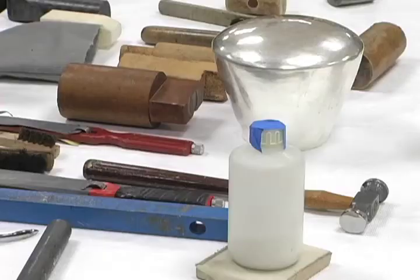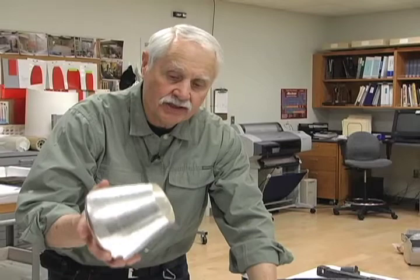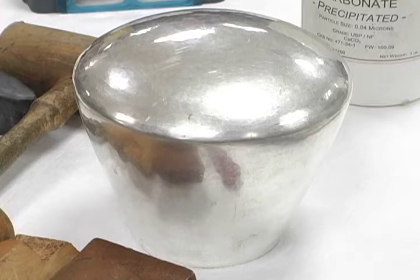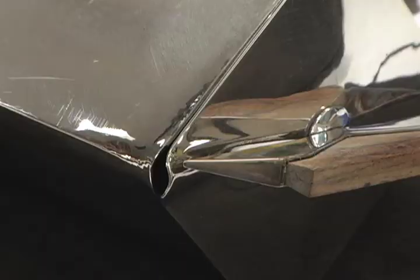To repair it, yes. But a lot of us metalsmiths are so fussy — the whole idea of getting it down to completely clean. This is why I really enjoy doing things myself by hand. Just like in this piece I'm raising right now, it hasn't been polished, but as you can see in the light there are very subtle undulations left because of the planishing hammer. If you came across here with a hard buff, you would just wisp all that off. This is why it's so great to get this information from you — we try so hard to keep your original intent and not interfere with your original marks.